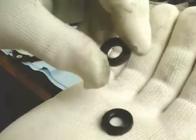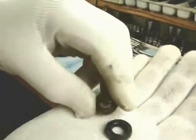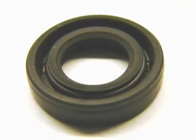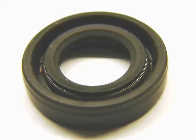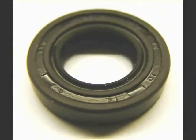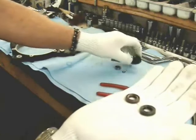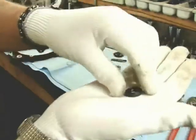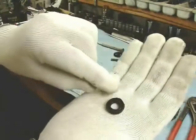The two seals are the same. They have a spring side and a wiper lip side. The spring always faces pressure or faces the liquid — so the spring faces the impeller and the spring faces the gear. Or simply make sure the springs are facing out from each side of the cover.